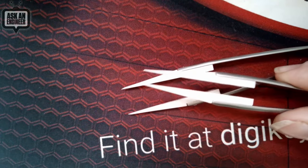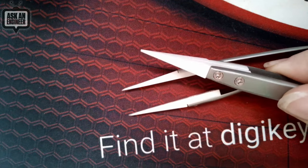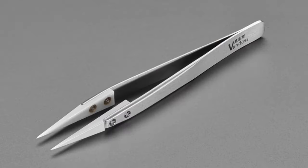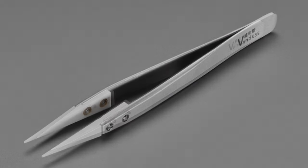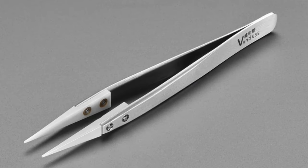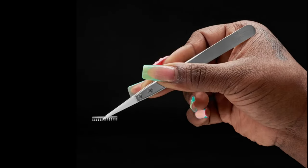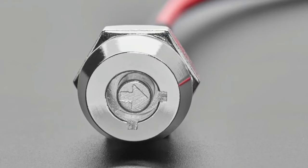For 0603s or bigger you can probably get away with these just fine, or 0402s — one or the other. Because they're ceramic, not only do they not bend, but they're great for use with hot air and rework. If you want to dunk something in a solder pot or grab something out of a solder pot, use these ceramic tweezers. Also non-magnetic and non-conductive, obviously, because they're ceramic.